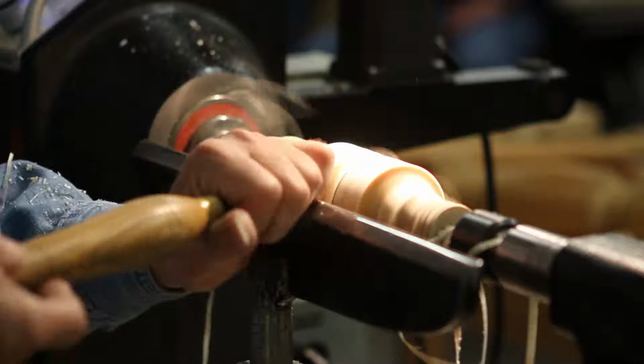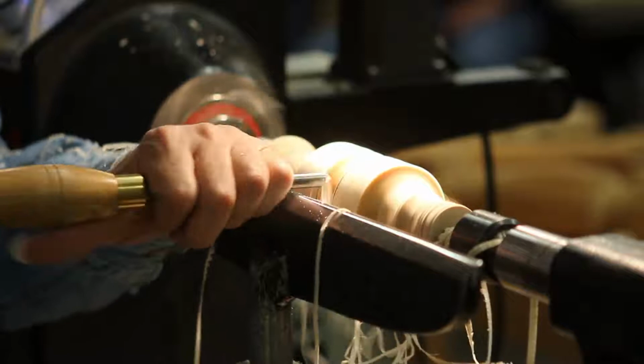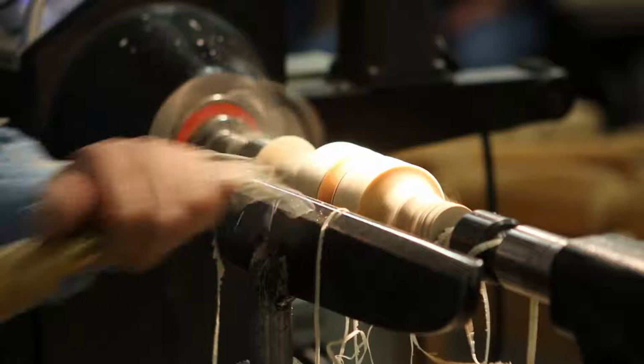And then after that, it's just a matter of getting the bottom. Now, you might need to be a certain depth here, and you check this with a caliper. So you widen and deepen until the caliper fits in there, and that's how you do a cove.